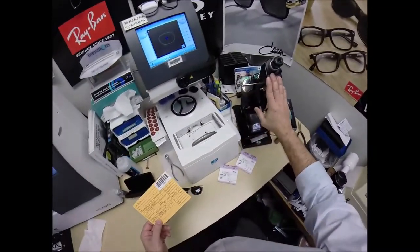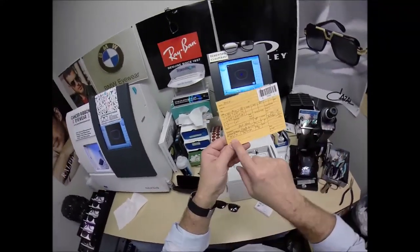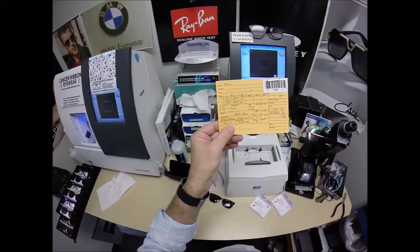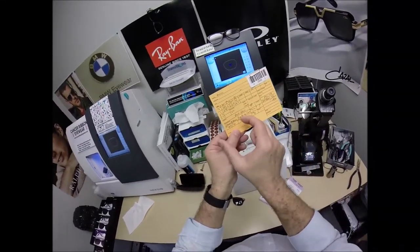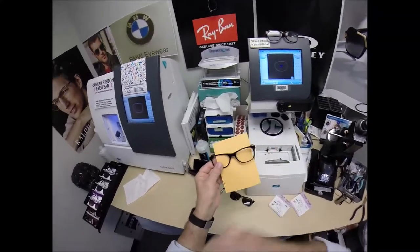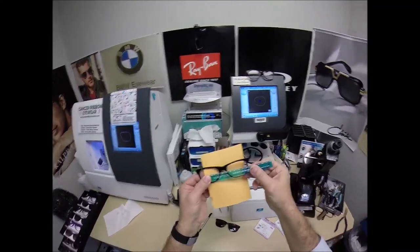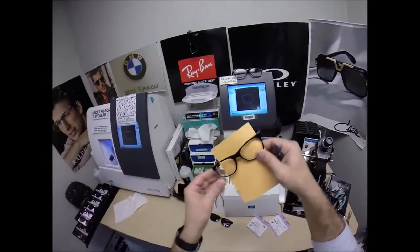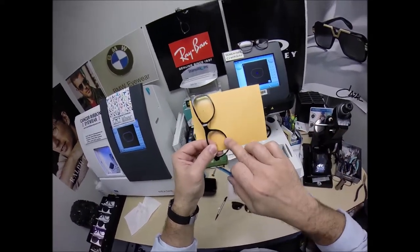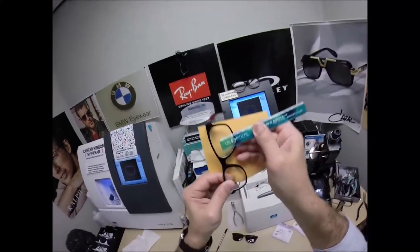This is what's known as final inspection — making sure everything is made exactly as the doctor prescribed. I want to measure the pupillary distance: 31.5 for the right plus 31 for the left makes 62.5. That's the horizontal measurement. The vertical measurement is 22. Holding the PD stick up to the left lens, we're getting 62.5. The optical center height of 22 — measured not to the bottom of the lens, but to the middle of the deepest part of the plastic — we're getting 22 millimeters. That is cut perfectly.